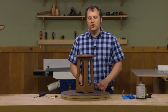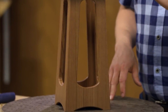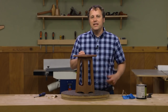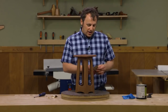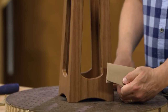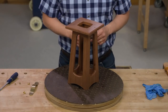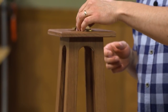I've put three coats of finish on the lantern, which is the minimum recommended by Old Masters on their can. It's really all about the look you're going for — I wanted something with just a little bit of shine but not too thickly coated. For being a water-based finish I'm surprised at how well it brings out the color of the redwood. Even though you're putting on a product called finish, there's still one more step: finishing the finish. I don't want to use sandpaper as that's too coarse, so instead I use brown paper from a grocery bag or craft paper — it's just abrasive enough to give the project a final rubdown. This removes any final dust nibs and leaves a really smooth satin finish. Once that's done we can reattach the handle on top.